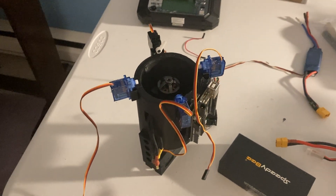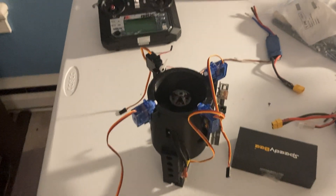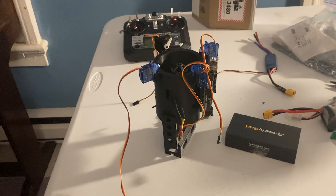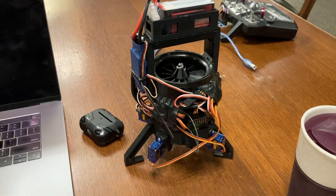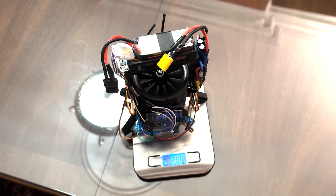I'm using four microservos to individually control the thrust vanes. From a control and weight perspective this is obviously less favorable, but it's mechanically much simpler. I'm using an MPU6050 as the gyro unit, which is pretty outdated but should accomplish what I'm trying to do. The wiring for all these components was a mess, but I was able to clean it up a good amount. In total, this first iteration weighed in at about 560 grams.